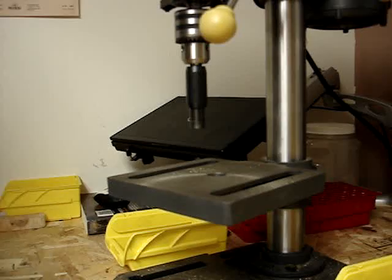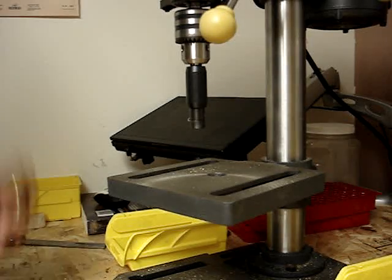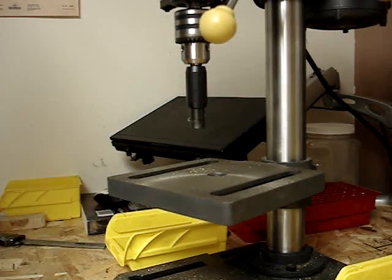This method is a little slower than normally using a Quick Trim, but this process allows me to have a very narrow window of trim length. This is for match case prep that I use. And for a $30 setup, not counting the cost of a drill press, it's a really effective and accurate way to trim brass.